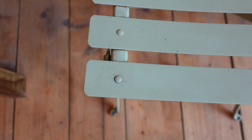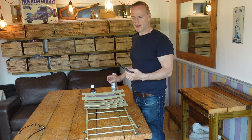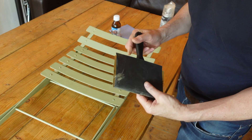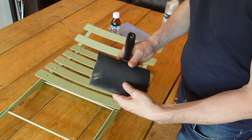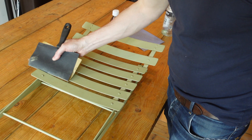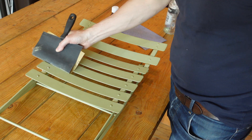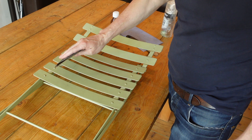Some bits of rust there. I'm just going to clean up bits of rust in places. The back's worse — there's some bits of rust there. First of all, I'll start by giving it a bit of a rub down, just with this sandpaper. I'm going to use a scraper, just so I can get into some of the edges. And then I'll rub the rest of it down, just to create a key for the spray paint to stick to.